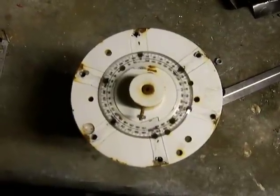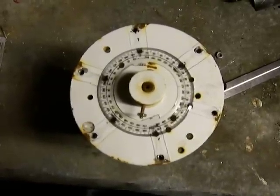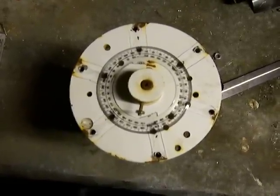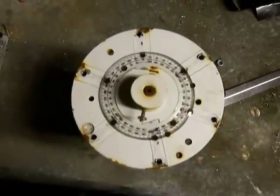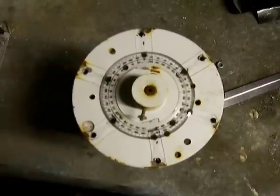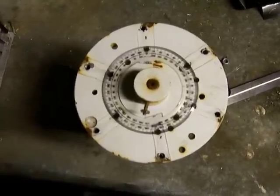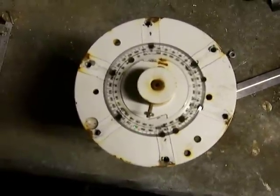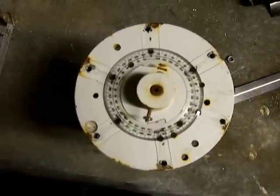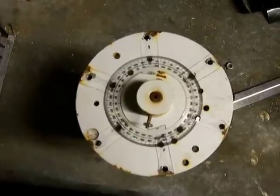We're doing a video on my experience with a treadmill wind generator hub. The way I approach setting up the blades is I bought a compass and I cut the middle out of it so I could place it in the center. There are six blades, so I staggered them at 60 degrees all the way around.